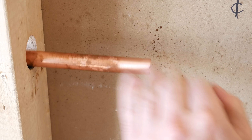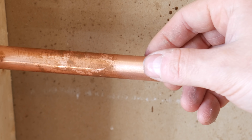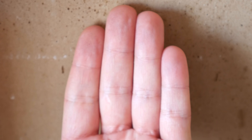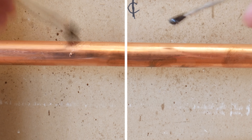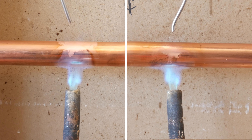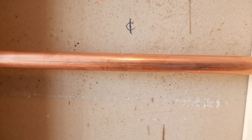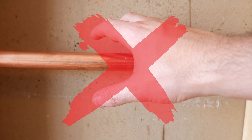Number 5 is touching the joint with your fingers. If you try sticking a sticker on an oily surface, it just won't stick. Our fingers constantly secrete oils. On the left is a pipe with flux on it, and on the right is a pipe with an oily fingerprint and flux on it. The one on the left sticks like it's supposed to, but the one on the right has trouble adhering because of the oil from my finger. So never touch the parts that are going to be soldered with your bare hands, or it might compromise the joint.